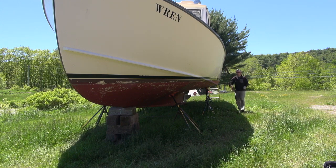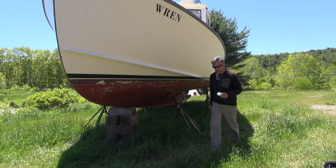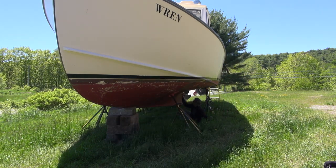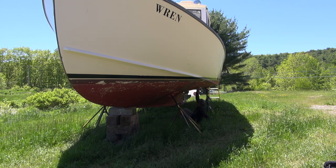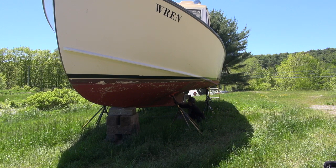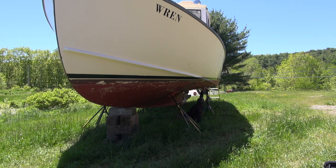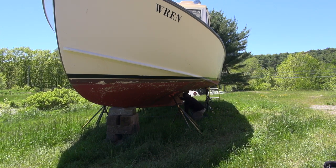Now I'll go underneath the boat. There'll be a wet box that might be wet, but we'll check that too. This is all dry. Now the core changes right about here. It's all the same reading. It's all dry, all in the green, way in the green. There's an engine intake back there. I think we'll look at that. Dry.